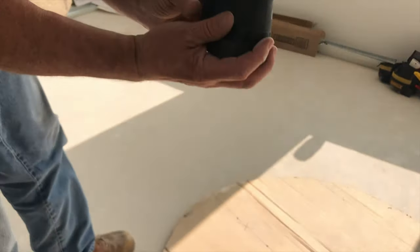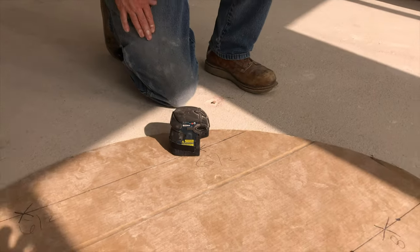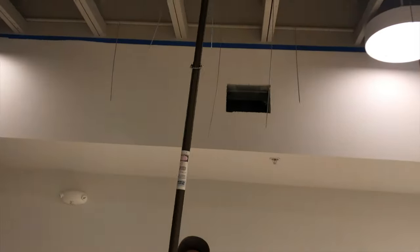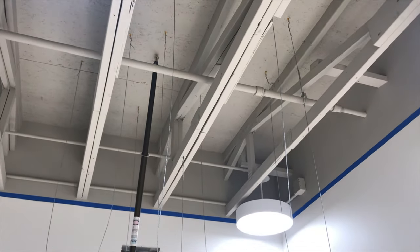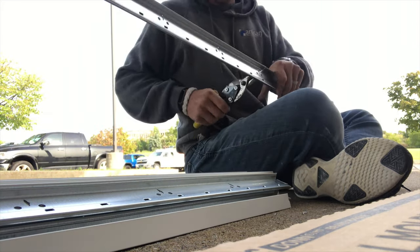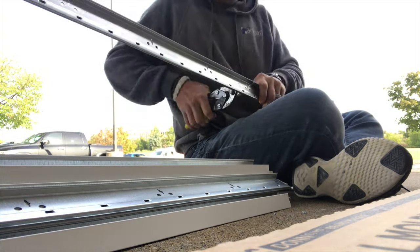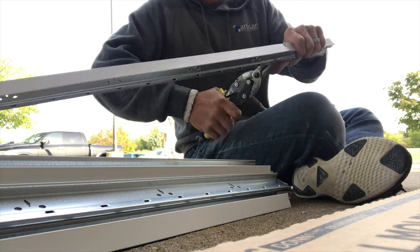We had the centers of all the circles marked out on the floor, and I had a cardboard template the same size as each circle with the grid lines marked in them. We used a plumb laser to transfer the marks from the floor to the ceiling so we could hang our wires exactly where the grid lines are going to be — that was the first step. We also had a lot of chunks of grid to cut to the right size to fit inside those Tectum clouds. There's probably a faster way to automate this with the bandsaw or abrasive blade saw, but we do so much ceiling grid that we're pretty fast at this method too.